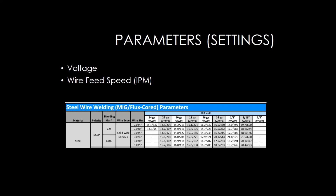Okay, perfect. I had a follow-up question to that, and I completely lost it. Dave's asking, my older Miller 210 doesn't have the digital readout, so what would be the best setting for 18 to 22 gauge? I'll lift up the hood and look for the chart, and it's going to give you your voltage and amperage starting parameters, and then you fine tune from there. Would that be correct, Ace? Yeah, exactly. Not all machines will give you the digital readout, but there should still be parameters on the inside in the door chart.